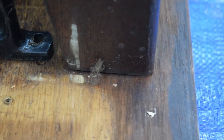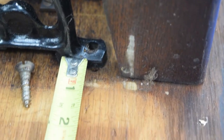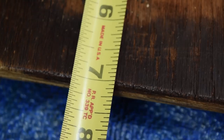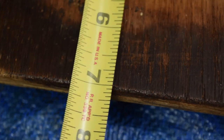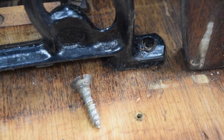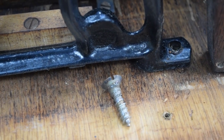And if I measure the distance from there to the edge, I get about 7.5 inches. And if I measure it over here, it's 7.25, and it's 7.25 on the other side as well. So it looks like at least one time in this machine's history, this cast iron base has probably been removed. All right, let me get these four screws out and we will move forward.